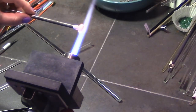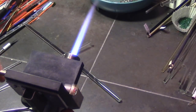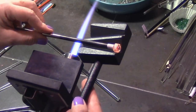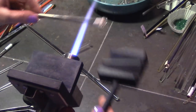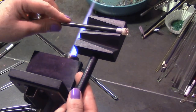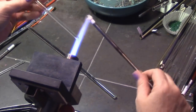I put a couple of wraps of clear around this blow tube and I'm trying to even it out, then thin it out to make a nice topper for my ornament. This will have the cap attached to it when it's finally done. You want to make sure this isn't too thick — try to make it as even as possible and fairly straight on the top. It doesn't have to be perfect because the cap will be covering it, but the straighter it is the better the cap will fit. It's about a quarter inch in from the end of the mandrel. The clear section sticking out of the mandrel makes a perfect base to attach the rest of my glass for the ornament.